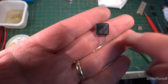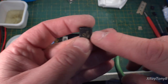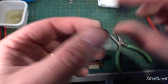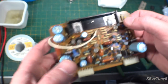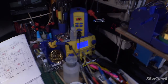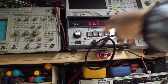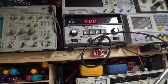I'm replacing the capacitors right now and getting rid of these black film capacitors. This one's six picofarads and there are actually four of these in the whole amp, and of course I have every capacitor except six picofarads. Not to worry — I have three picofarads and I just mounted two of them in parallel right up in here. Just so you know, you can do this, it doesn't hurt anything. Here I have them attached to my meter and you can see right around six picofarads — it works just fine.